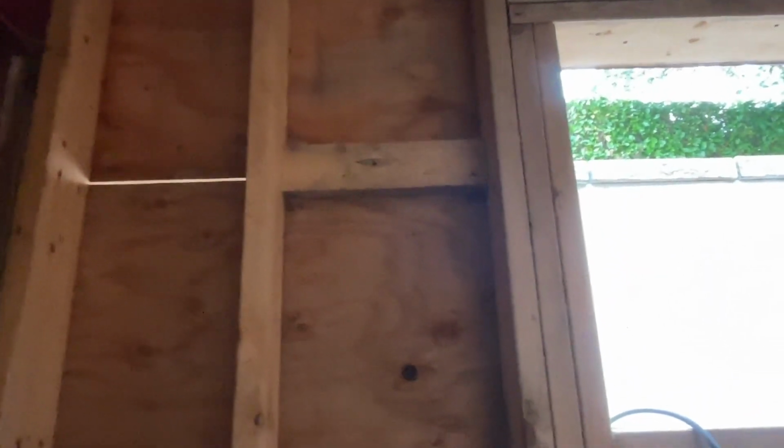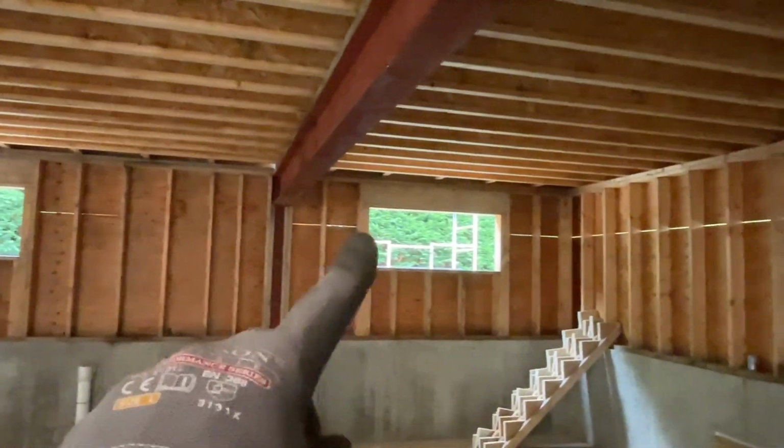So I'm doing that. And also, in conjunction with that accommodation for earthquakes, they want these blocks put in between every 2x6 and stapled or nailed every 3 inches on the backside through the plywood. It's only on the 2 ends of the building, and what that does is stop potential twisting action if there's an earthquake. So that's what I'm going to do on this rainy day. I probably won't get into the earthquake hardware, but I am going to do all this blocking. The blocking will go right along where you see that line there, but not here. So lots of blocks to cut and install.